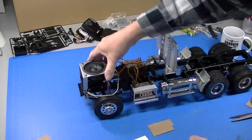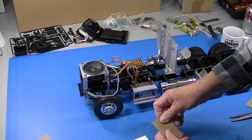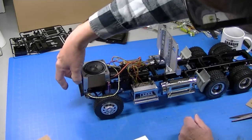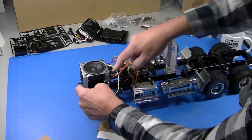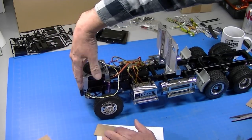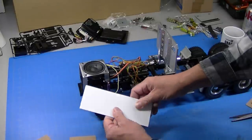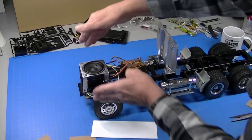I mentioned earlier boxing in the speaker for better sound. I've done it with just clear packing tape, but lately I've used plastic. I've got a piece of cardboard here — just cut a little template that slides in here to make sure everything fits. I like to do the cardboard template thing. You can see how that boxes in the sides. I'll cut that out of plastic and put some double sticky tape on the back of two side pieces. That also has the advantage that when you look through the grill you won't see anything. I use old sign plastic — for sale signs or any similar plastic works fine.